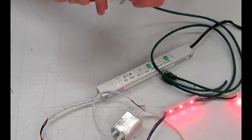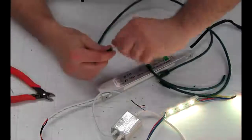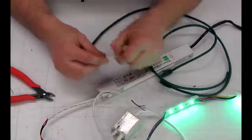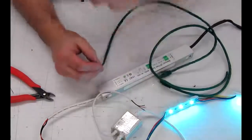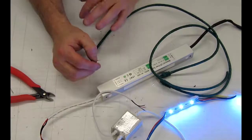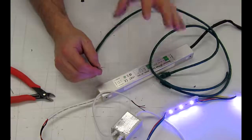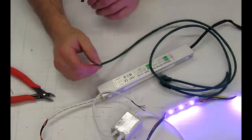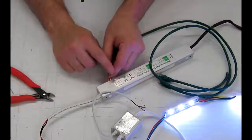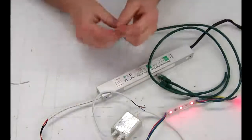The only cable we're going to need in here is the orange and white-orange. That is the pair used for DMX in a normal DMX setting. If you're using these with LOR controllers, there are some different options. If you want to run your LOR controllers in DMX mode or use an LOR dongle, you can either build an adapter to adapt it to the standard orange pair, or adapt it using LOR's wiring scheme.